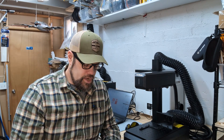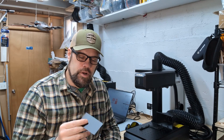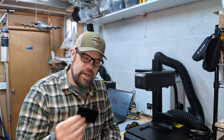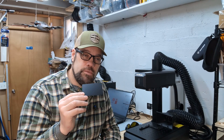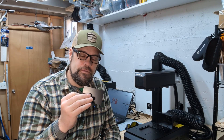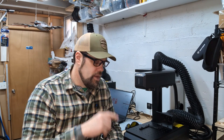I'm using some flat black aluminum cards I picked up off Amazon. When you engrave them you get a nice white contrast, which works very well for business card type things. To get the best quality and detail I make two passes: 4,000 millimeters per second, 90% power, 30 kilohertz frequency, starting at 45 degrees then rotating 90 degrees — that gives the best detail and contrast. These business cards take about 40 seconds each. I've hooked up the foot pedal so we can swap a card out, hit the pedal, and it advances the job.